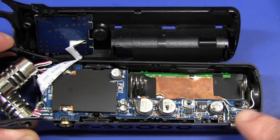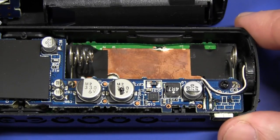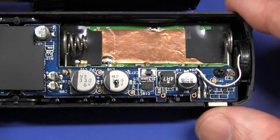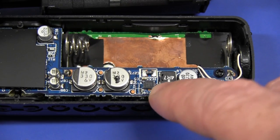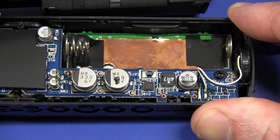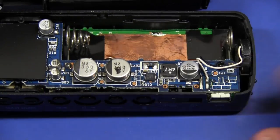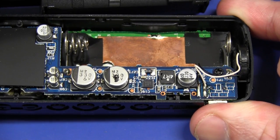You need a DC-DC converter because it's only a single AA cell - only 1.5 volts. I don't know what voltage it operates down to, maybe 1.1 minimum, or if nicely designed maybe 1 volt or 0.9 volts minimum. You obviously need a boost step-up DC-DC converter for that. I looked at that chip under the microscope and it uses some weird code mark - not readily identifiable. But it's a basic boost converter. You can see the gold test points there - those are for the production test jig. They would have a bed-of-nails tester to test each individual board.